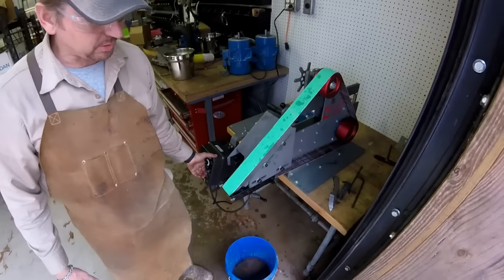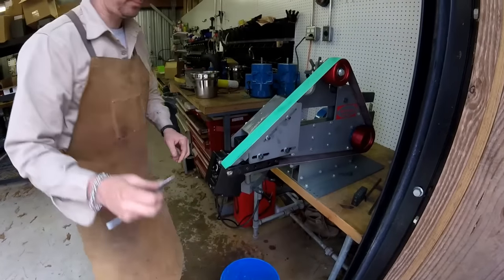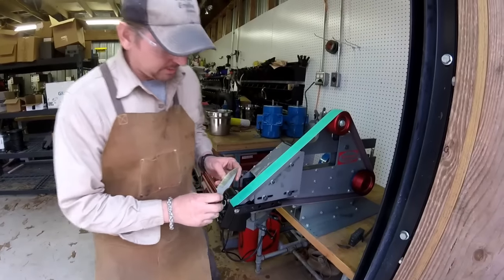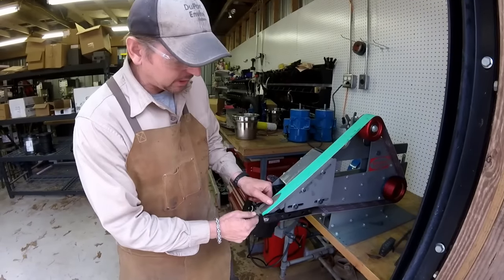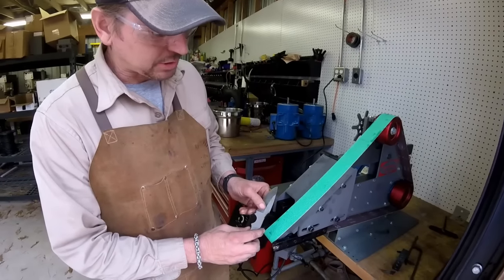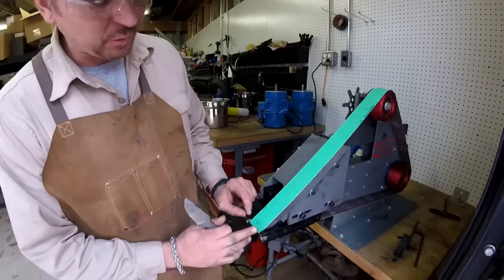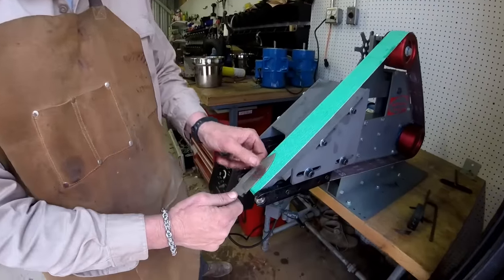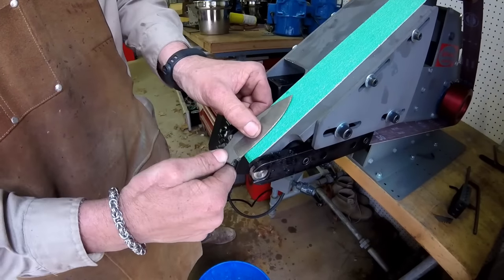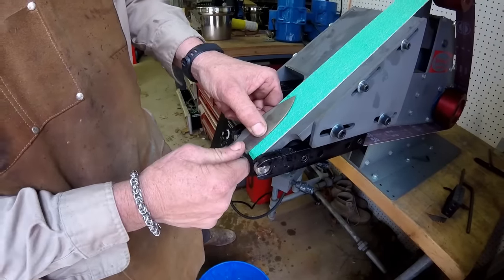We're going to turn the speed all the way down, then turn it on. That looks good. Now we'll get the knife. When I'm grinding, what's happening is we're going to get a beautiful convex — just a beautiful plunge, a real sweeping plunge, not this crisp thing I've got now. It's going to be a real nice slow rolling because it's going to be created by this small wheel. It's important when I'm grinding that I'm pushing flat here, so it's going to translate into being flat here. You don't want this to rock too far this way or that way or you'll take it up too high. It's really important that you're pushing down really hard, and then I push in.